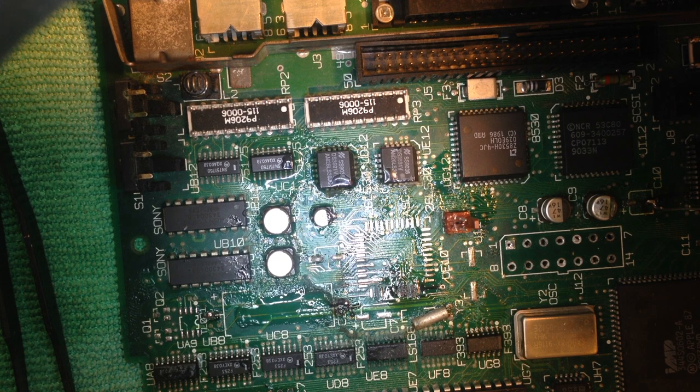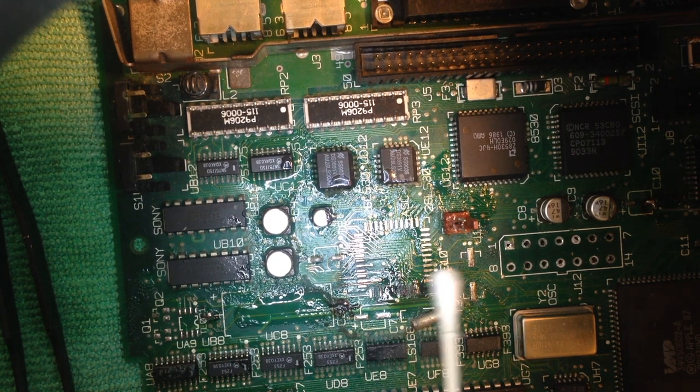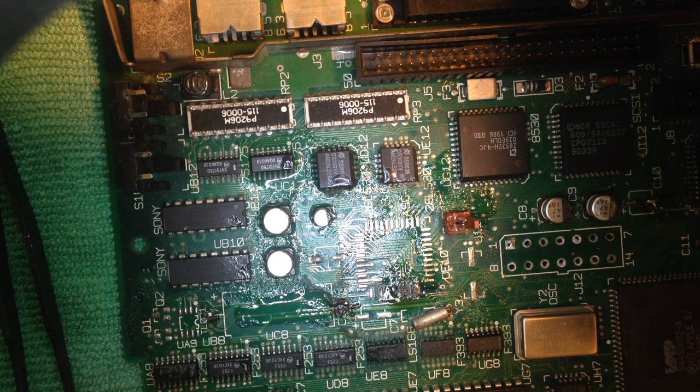So once I cleaned that board, I rinsed the logic board off with my filtered water, and then followed that by dropping the logic board in a bath of 99% alcohol for about 15 minutes. This removed the remaining moisture of the board. The final step is to put the logic board in my little heater oven, where I heat the board to about 130 degrees. Just enough to let the alcohol and the 1% remaining water from the alcohol, since it's 99%, evaporate.